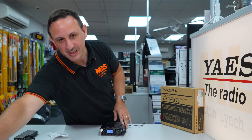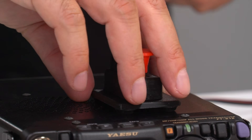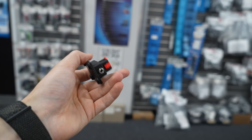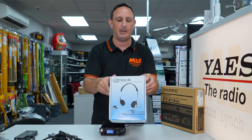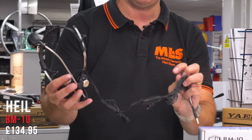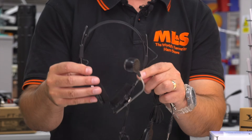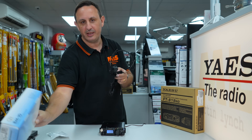For CW, a nice little straight key with a 3.5mm jack goes straight into the back. If you don't want to do CW and want a headset, the BM10 from Heil connects with the AD-1 cable assembly — nice and lightweight, comes with a PTT, dual headset in a walkman style, with a windshielded microphone. Great for contesting or SOTA activations.